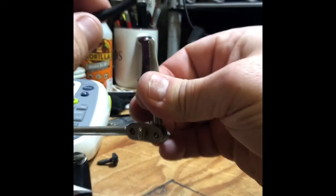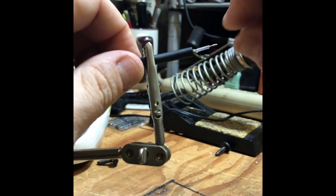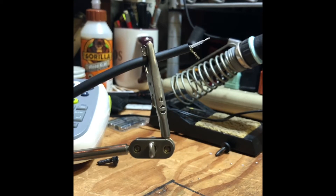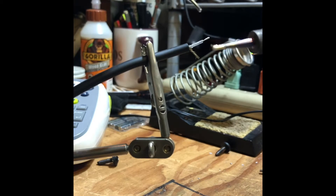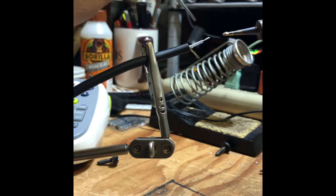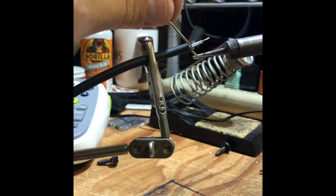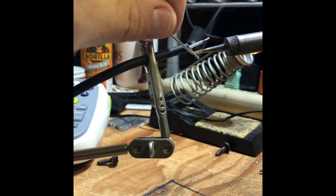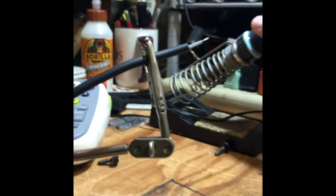Let's put this in here so I don't have to use a bunch of hands. Let's get these guys kind of set up — it's nice to have the extra set of stuff. I got the old solder gun. As you probably watched already on YouTube, it's easier to tin wires if you got a little bit of solder on there — just a little bit — and then you'll see it just kind of sucks in there. Got that one's pretty juicy.